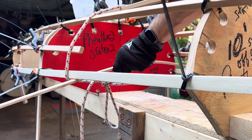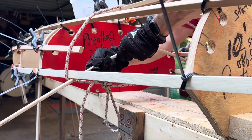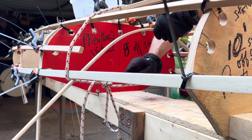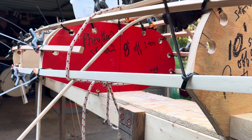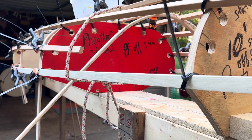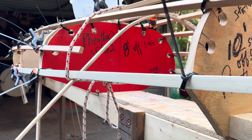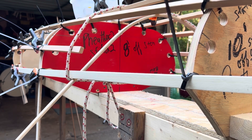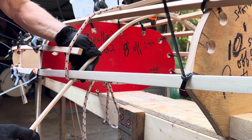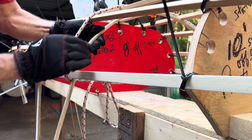Here's the last one. You'll notice there's a green piece of tape on the end of that rib — I realized there was a weak point I wanted to avoid when I started bending. Here I am pulling up, bending it in, getting that first clamp on in the middle. You'll notice I've got a rope there tying in that half rib to make sure it holds in the proper position, so that my rib ends up in the correct place. There's going to be some pressure against that half rib, hence the rope.